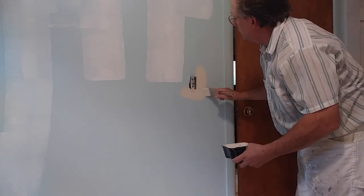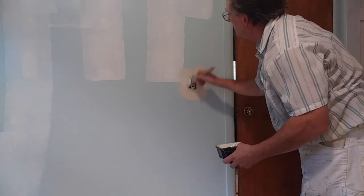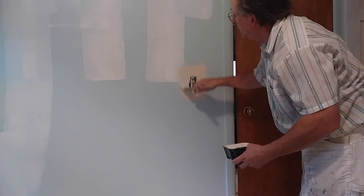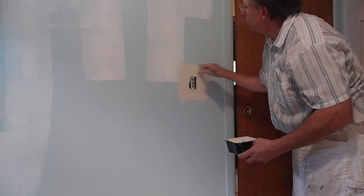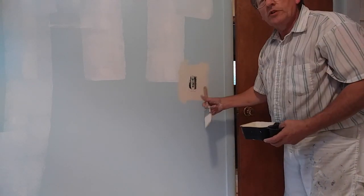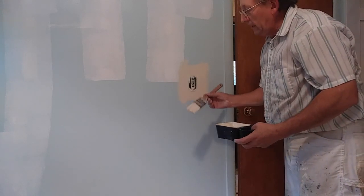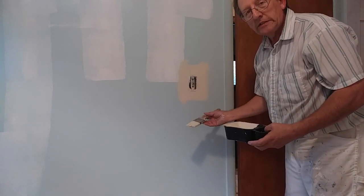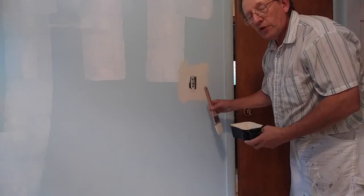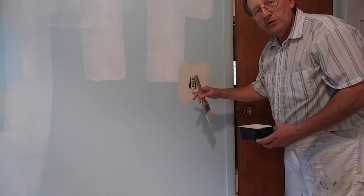Cut that in, recover it all real good — need a little more paint on there. There's one coat with the brush now. That's not going to cover it. It says guaranteed one coat cover but they don't tell you exactly how — with a brush you can only put on so much at a time, otherwise it's going to run. Anyway, you put this one coat on, let it dry, and you're going to see some of that blue still showing through, kind of a transparent look.